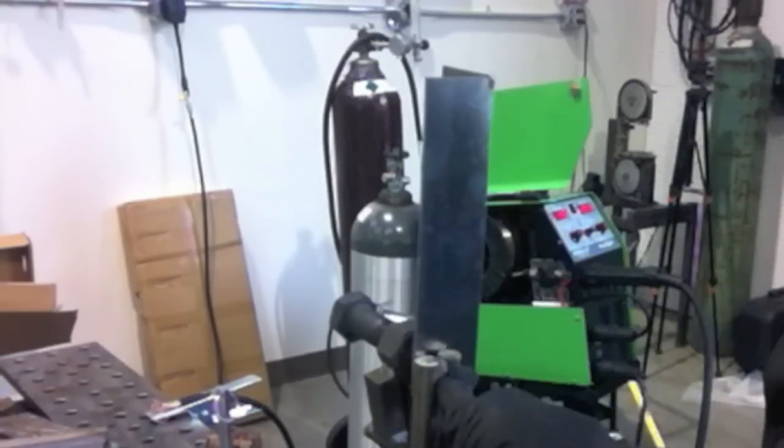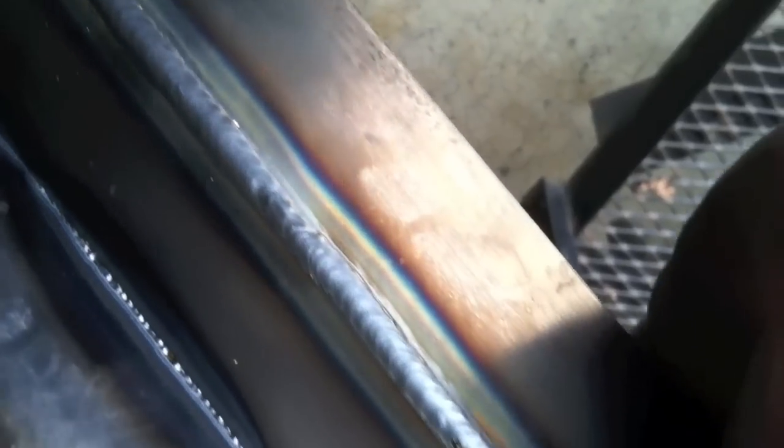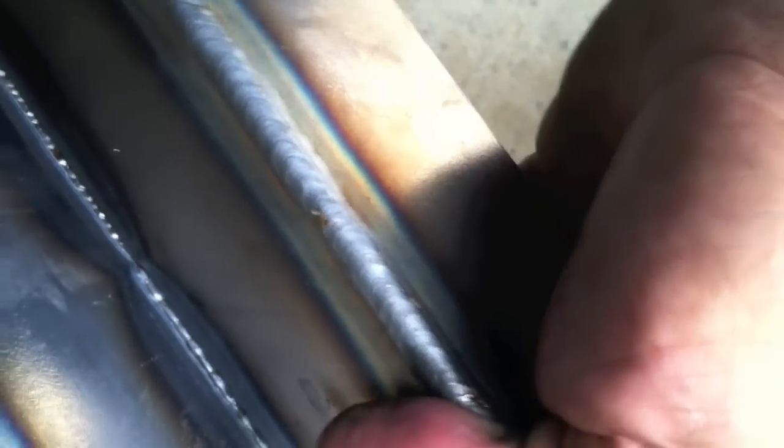I always like to make a few little dry runs in position, make sure I'm in good position. On a downhill joint like this on this thickness metal — roughly an eighth inch — there's many different techniques that work, but a series of overlapping loops just seems to be a go-to method for me and works on most anything. You could go forward and back or just a zigzag downhill, but most anything will work. Just find something that works for you and roll with it.